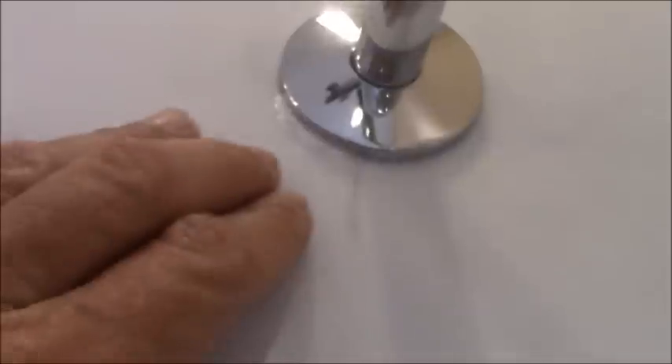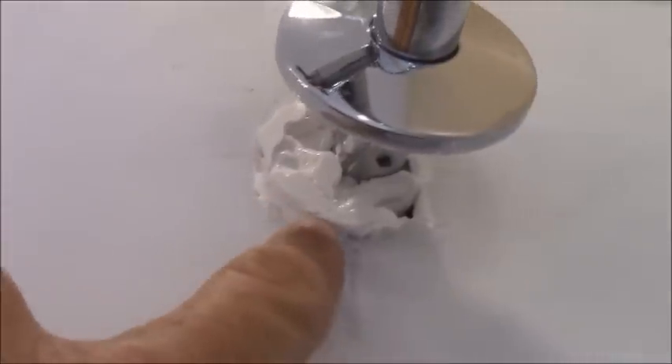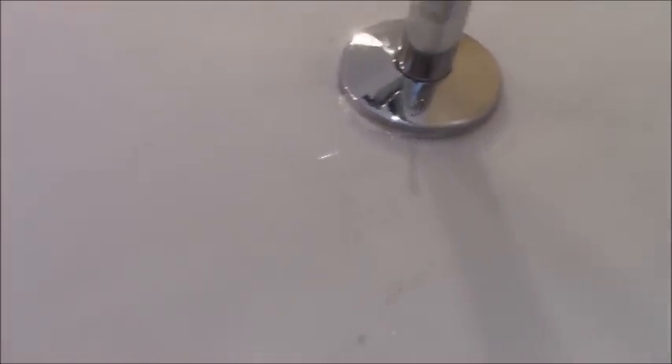Here's a scratched tile — it's got a huge double scratch on it. No grout at the bottom here, right next to where there's no grout. There's no caulking in this corner — all it is is just straight grout that's going to end up popping out. There's a tile hole cutter that's only $6 or $7 and they didn't use it. They back-cut a square in here and then just filled in the void with caulking rather than use the tile hole cutter.